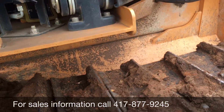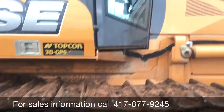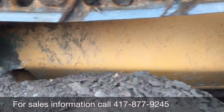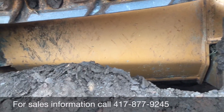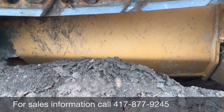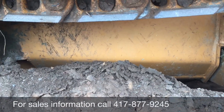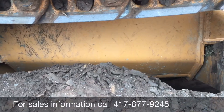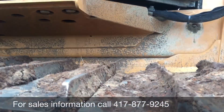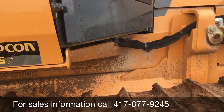We don't have to worry about cables or anything getting torn up on the side of the machine. The main reason we had done that is down here — it's hard to see on the video, but the body actually tapers out. You're not straight in line with the alignment of the dozer. As it goes to the back, it comes out away from the machine. So to get around that, we tried mounting the sensor in that compartment, which it seems to perform very, very well.